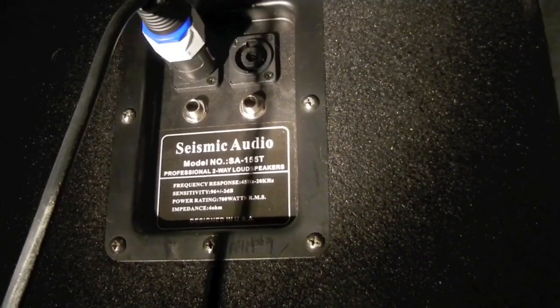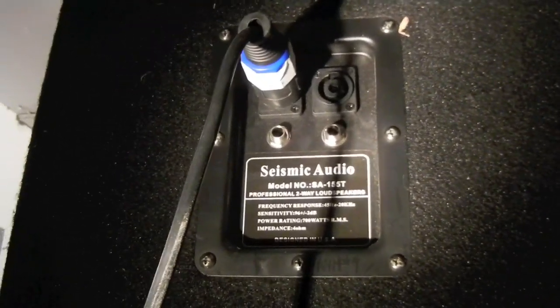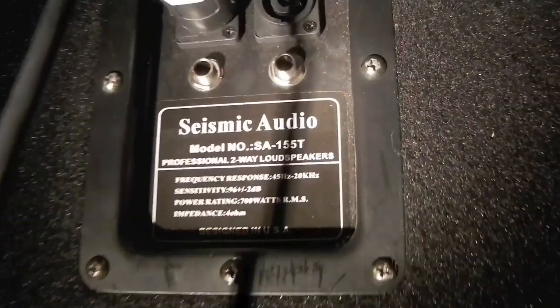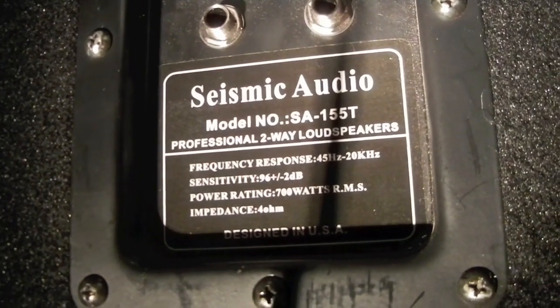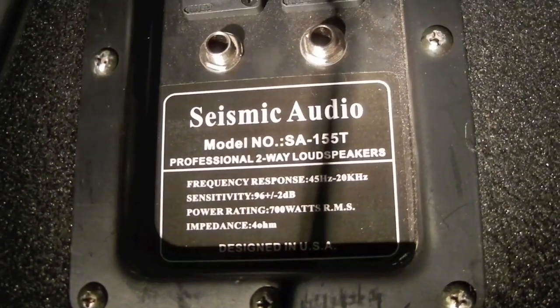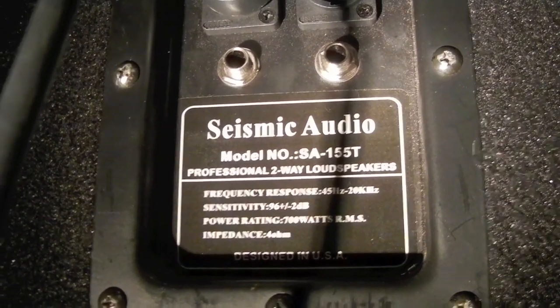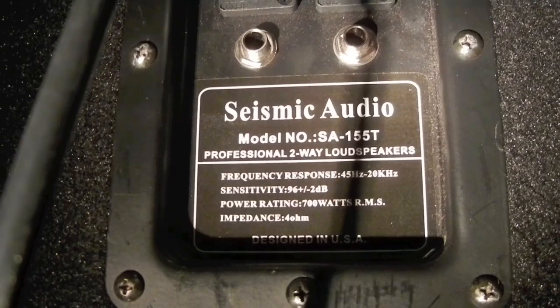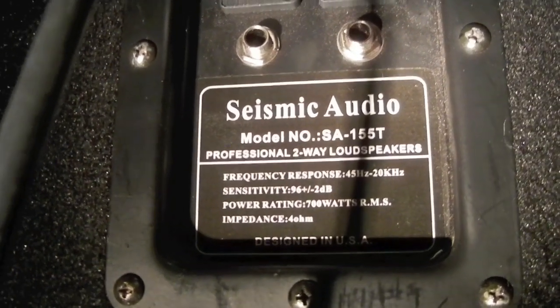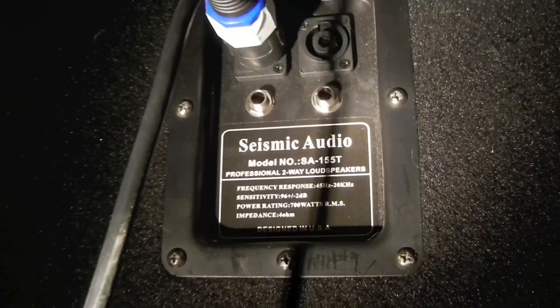So if you have an 8 ohm, look at that rating. If you plan on running 2 speakers together, just make sure the amplifier can handle it. So it's just kind of quick advice. You can look up more information on ohms and ratings, but just always try to match your power amp with your speakers. So you look at your stats, 700 watt RMS and 4 ohm impedance. It's always going to have a label on it. Read the stats and just try to match it up.